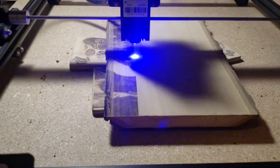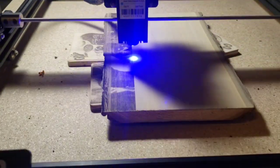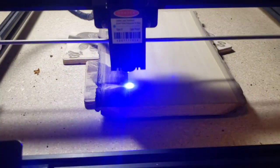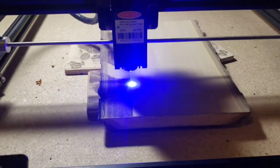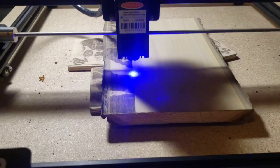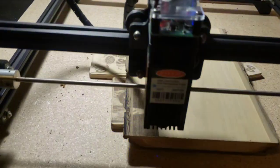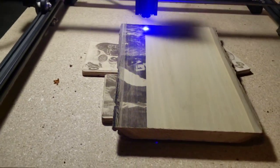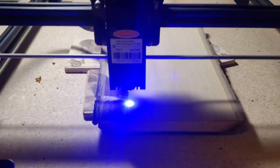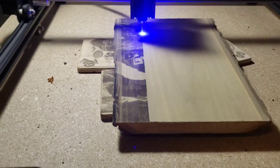This has a 50% Kenny Hack aging stain as a base coat, and then I put on a really heavy coat of latex whitewash that I covered in the last video to whiten it back up. It's still darker than the stock wood color, but overall it's pretty white. Given the power I'm running, I could have put another coat of whitewash and gotten it even whiter and still maybe only had to bump up to 40-45% power.